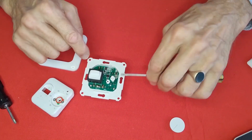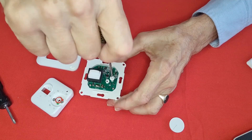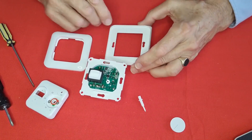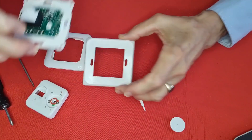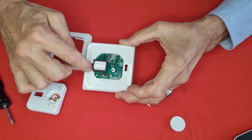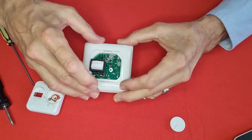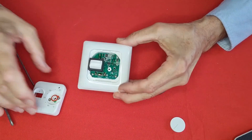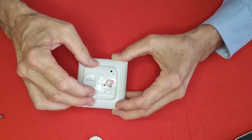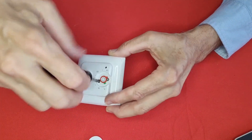It can, if needs be, be adjusted with a small screwdriver, and that comes in handy once you've done the fitting. To reassemble, assuming this is ready to go on the wall: drop that part in there, put your mounting screws through onto the wall socket, add the surround, put the control knob into place, then drop this part into position, insert the screw, and tighten up.